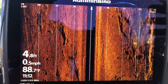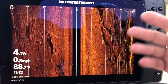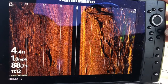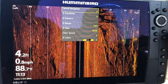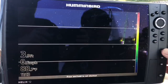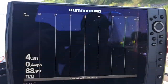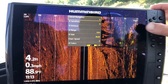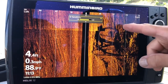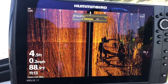Here's how to set the settings on your unit — this is the way I like to do mine. You can see on side imaging here we've got it right about 75 feet and you can see a lot of trash in here. If you hit the menu once — with just one screen up, not a split screen, whether it's side imaging, sonar, or down imaging — come down to sensitivity and watch as I move it. You'll be able to see if the picture gets clearer or fuzzier.